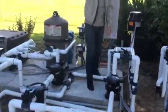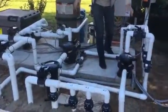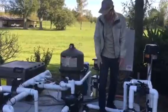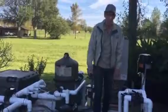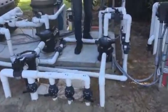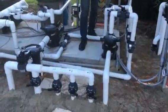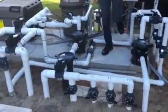But it's more energy efficient to use one pump that you can work everything at once. So now you can work your bubblers, your fountain, your overflow. When you're in pool mode, when you go to spa mode, you have to turn the other pump on so you can work the little fountain heads and the bubblers. Or vice versa, if you just wanted to run some water features but you only needed maybe four or five hours a day in the winter to filter, you could still run this little energy efficient three-quarter pump. You could run this one for 12 hours with company or people in and out, and it looks like everything's working on the pool, but you only need to filter so many hours so you don't have to run the big pump. So it's more efficient.